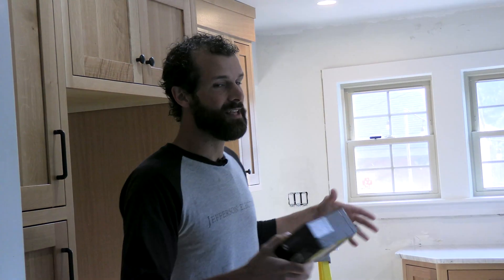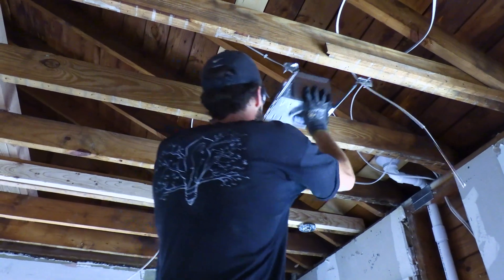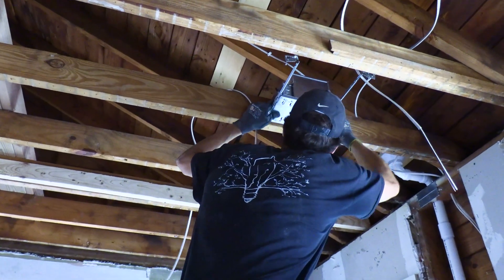You've got to match the aesthetic that's in the home. So if the dining room is operating at 4,000K and the living room is at 2,700K and you put 3,000K in the kitchen, the customer's going to say this doesn't look like my other spaces. So either you're going to be swapping out retrofits, or you're going to be upcharging to fix the other spaces and get them to match.